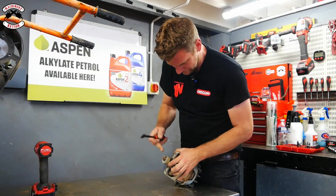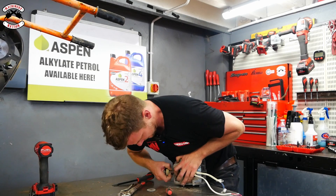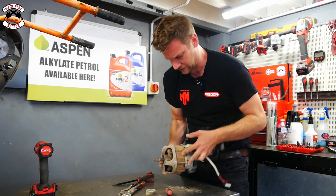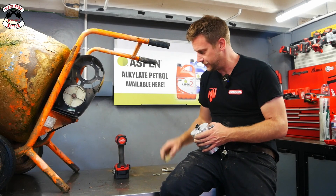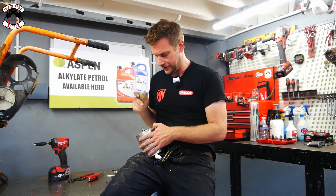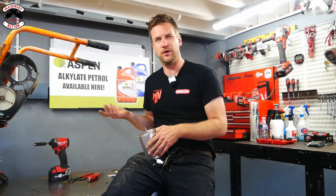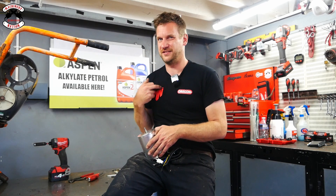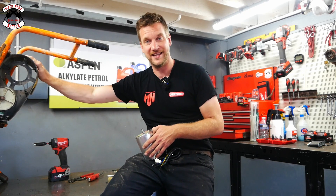I need to get this pulley off of here so we can reuse it. The problem is that pulley is a lot bigger than that shaft, so I need to make up a spacer in between. The problem is I don't have a mill, so it's not that easy. But I'll work it out — just weld something on there, push it on there, and as long as it's tight it'll be fine. I'm going to make up a shaft and then try and fix that motor in there so that can go onto there.